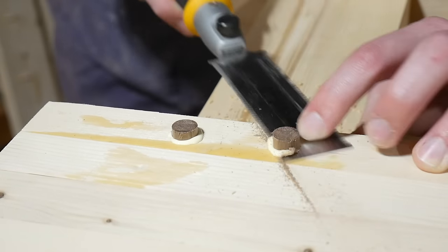After a bit of digging, I found online that a good way to do it was to lay out a grid of screws like I've done here. Before I start gluing, I lay out and preset those screws in place. Then I start gluing up the top, covering the entire face with glue, stacking the sheets, and leaving the one with the screws for the top. By top, I mean that the side with the screws is actually going to be the underside of the top so that you don't see it. Once you have that lined up, I clamp it down with 4 clamps to keep it in place, and then I put all the screws in, and that's basically acting as my clamp.